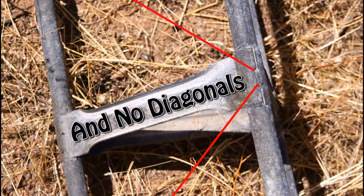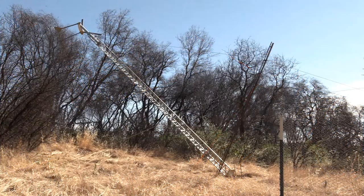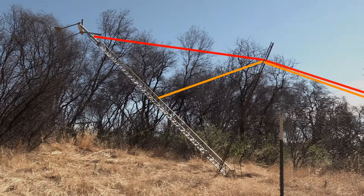I don't know on this one — better to be safe than sorry, though. So the way to deal with this bending problem is to use the lower guy cable at the halfway point and hook it to the winch too. So when the tower is being raised or lowered, both places are being supported. And even for this rigid tower, if it had been longer I would have used this second cable also.